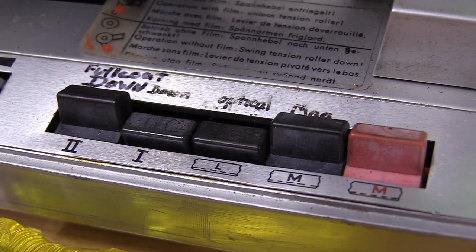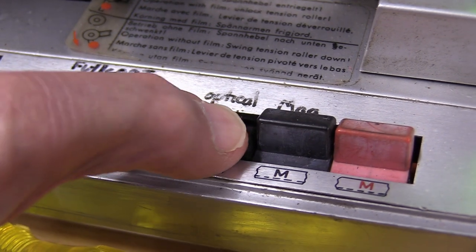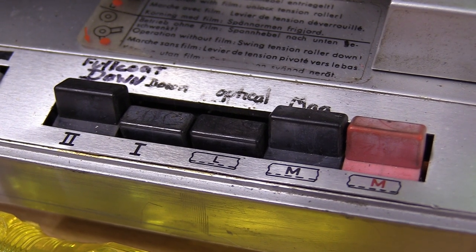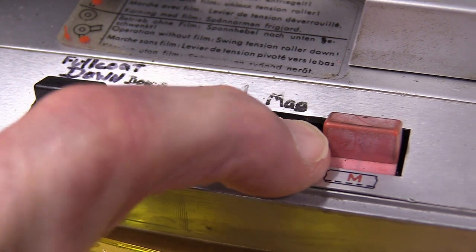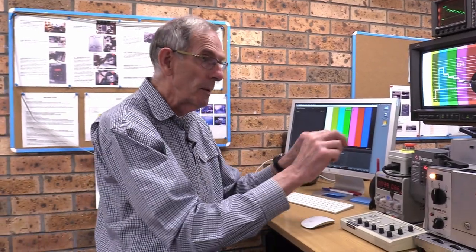You need to refer to your sheet to see whether the sound is optical or magnetic. Wherever you see optical sound, you need to make sure that's pressed down when that piece of film is running through. And if the magnetic film is the next thing coming up, you need to press that button and change the selection. It's a little bit more complex than that — there are a few intricacies about the projector and the system, but you'll find those all in the documentation manual.